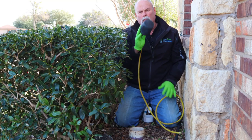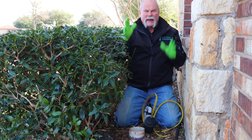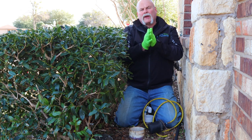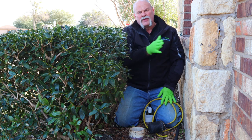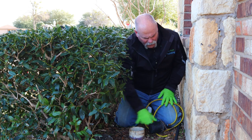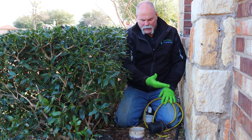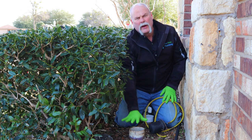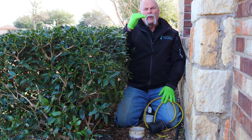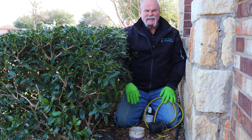We're going to take this test ball, stick it in this cleanout, and position it right down in between them. That way we can take a look down in the other side to make sure no water is going past it once we fill it up. This cleanout is almost at slab level — actually up at slab elevation — so when we start filling it with water to this level, we know everything below the slab is being tested.